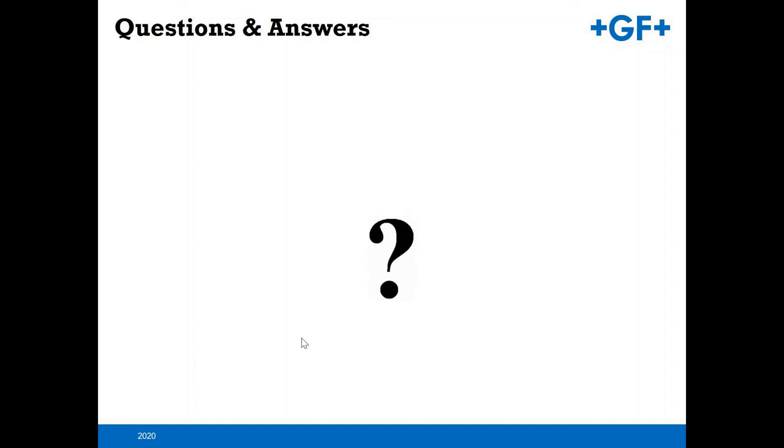All right. And the last question so far was, would a Signet 3-8150 with a 515 paddle wheel work on a 2-inch pressurized gray water discharge line with a pressure of less than 30 PSI? Assuming the gray water does not have particulate in it that could bind or cause abrasion, as long as the pipe's full, it should be a good application.